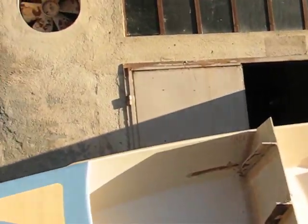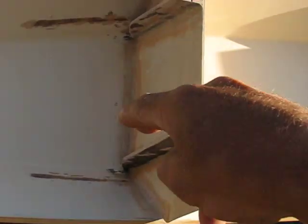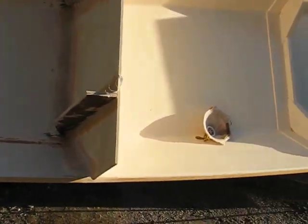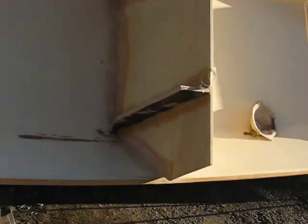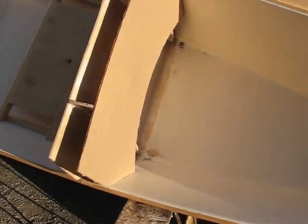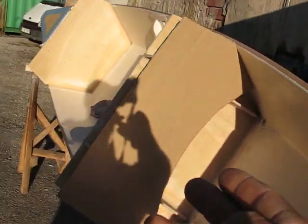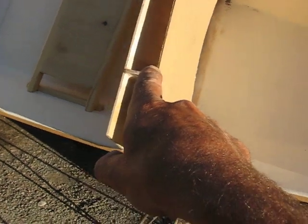So this is make or break, this is what it is. Over here there's a 6mm bulkhead — the ama comes smack on top. These are two ribs, 8mm — MDO ply that I had, so I just sanded them, glass taped and filleted both sides, glass taped only one side. Now what's going to happen is — here's a cardboard template for the next half of the bulkhead. That gets me out another 6mm ply piece, that gets filleted and glass welded onto the hull, then filleted and glass taped onto these two ribs.